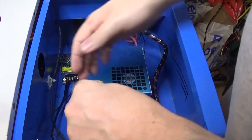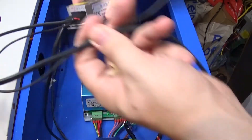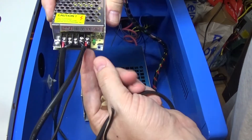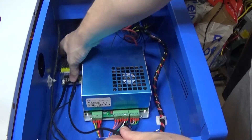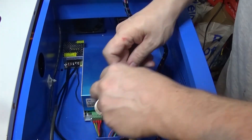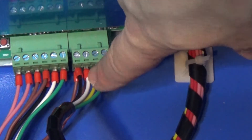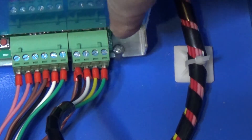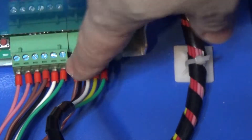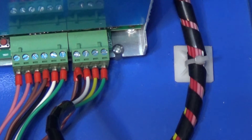Next I've got to connect the ground. That's all wired up now. On the DC side, I've connected two ground wires to the ground side of the DC, because I need to connect the ground to the actual DC side ground of the K40's power supply as well. I'm going to bring that down and round and plug it in. On mine there are multiple things already plugged in, so I'm actually going to have to cut the wires and crimp them all together — all three connected to one — because there's too many to fit in. Do not just take where I'm saying to put them as gospel. Check your power supply first.